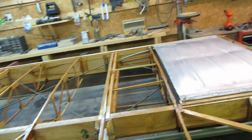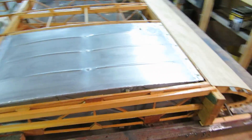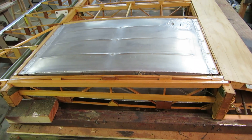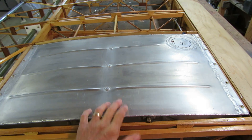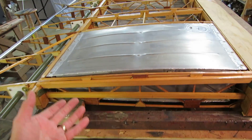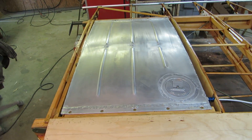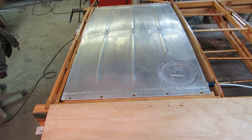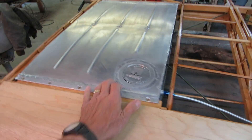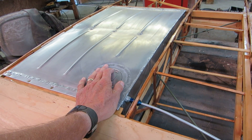Another example of make do. The idea with this tank was to get as much fuel capacity as I could out of the wing bay. So I made the tank the airfoil shape — it doesn't get any cover over it, it's the same shape as a rib. That's a complex tank to build. Joe Engelman built them for me in Kansas City; he's an excellent fabricator. He cut the first two up. On the third one he was satisfied, but he had to go to 050 thickness, mostly because it wanted to warp so bad, but also for strength. It's a big tank — it's got to carry the air loads as well as the fuel and the G loads.